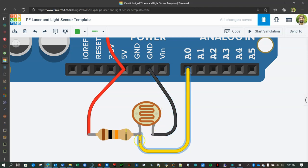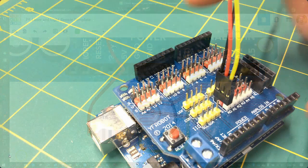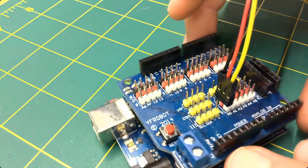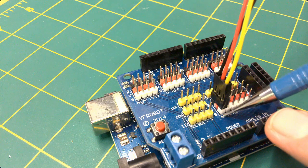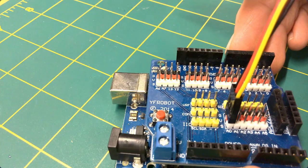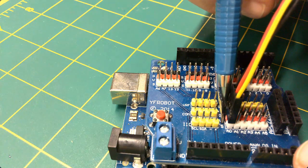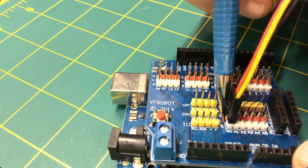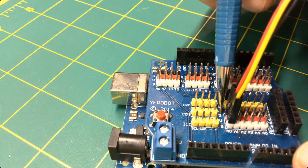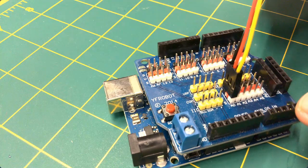The yellow signal wire connects the junction between the two resistors and the signal pin labeled A0. When you arrive in the lab, you will connect your light sensor with a three-conductor cable to pin A0 on the actual microcontroller board. Match the yellow or white signal wire to the S-row, the red power wire to the V-row, and the black ground wire to the G-row. You should make notes of this in your notebook.